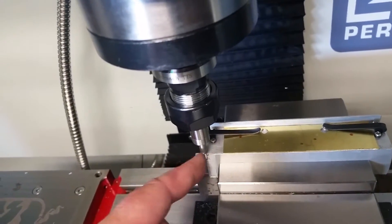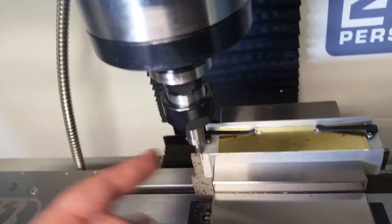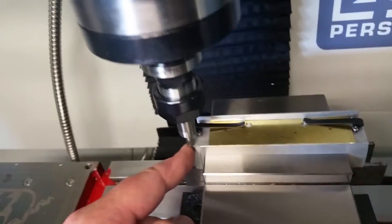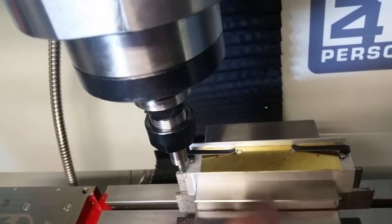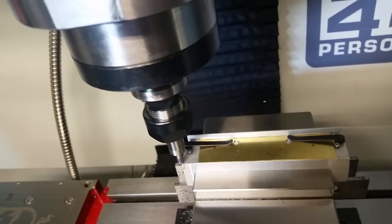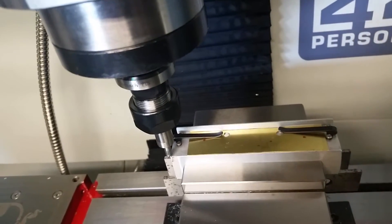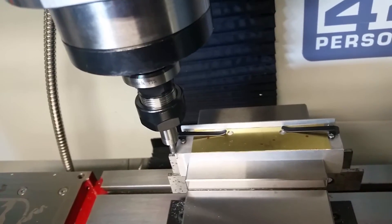Now I'm going to go back and work out the G-code for drilling where I want the holes based off this XY zero. For my single-part fixtures I'm just going to base everything off X and Y zero right there — that makes the most sense to me. The idea is I stick a piece of brass in, drill four holes, pull it out, stick another piece of brass in and drill four holes. The tolerance on these parts for liners is within five thou, so I'm golden.